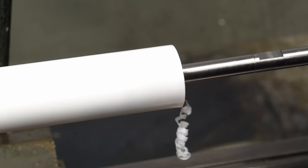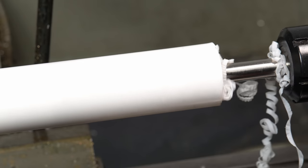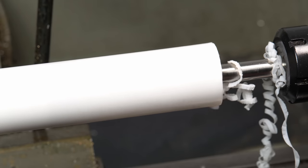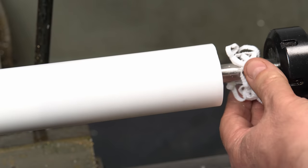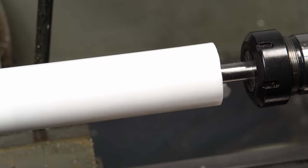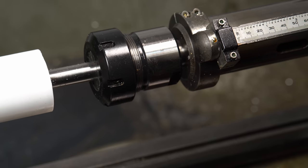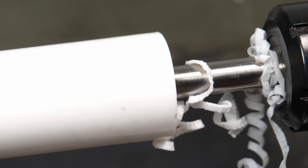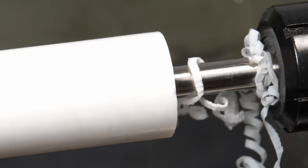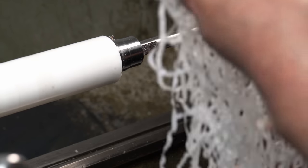Of course, the head was now not rubbing inside the enlarged diameter for the first 3 inches, and with PTFE being rather wobbly stuff, the cut went eccentric and made a proper mess. I bodged up a pressure roller, as I still don't own a steady rest or a travelling steady, and tried again. It was still a bit out of true, but after that 3 inches, it centralised beautifully and was back to cutting true. However, the first bit of the tube was now rather skew-whiff and wibbled back and forth by a few millimetres. Let's pretend we hadn't seen that.